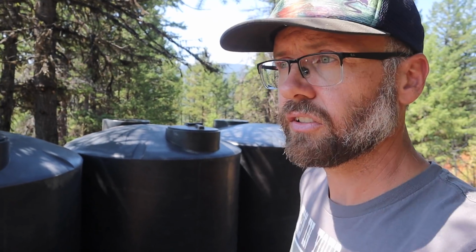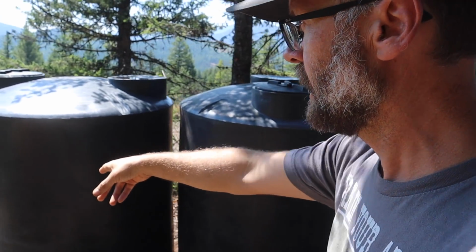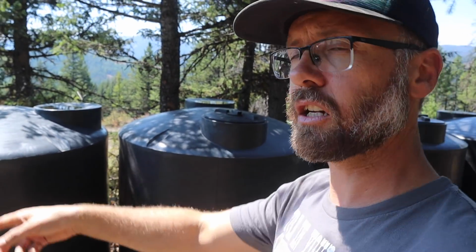The second reason is it's decentralized. So what I've also done here is I've put water in a second location 360 or 350 linear feet away from the well site. It's actually maybe a little bit less. I've got about 350 foot of pipe, Prime 100, 1¼ inch to come up here. The line can hold 100 PSI, which is more than adequate. And so I've got water in a second location,